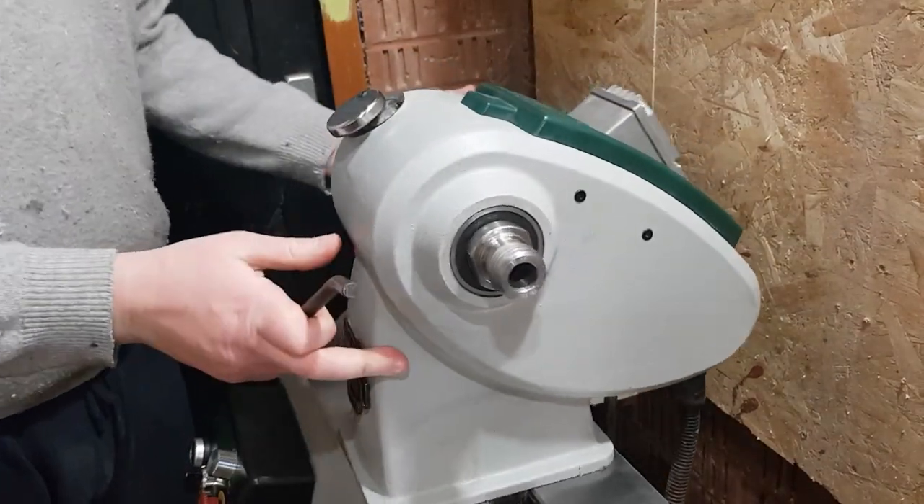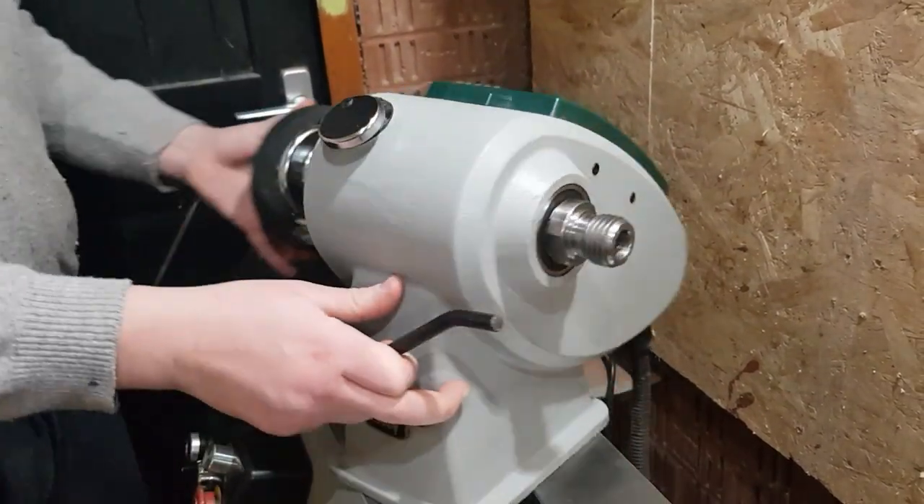One last thing that can make your life easier is a swiveling headstock. A swiveling headstock means you can turn the headstock 90 or 180 degrees to allow for outboard turning. This feature is also helpful when you have limited workshop space — my workshop is wall to wall four foot. I quite often turn the headstock just a little bit when hollowing out the inside of a bowl or doing hollow forms. This allows space for longer tools and different cuts, for example an undercut where the handle of your tool needs to be on the opposite side of the lathe. It also means you don't have to lean over the lathe, which reduces back pain — something really important for longevity in this hobby.